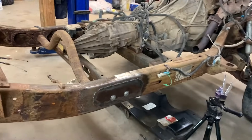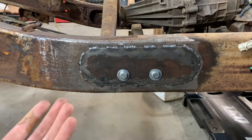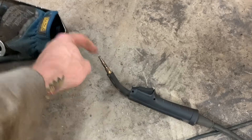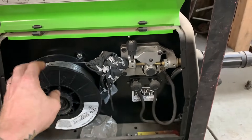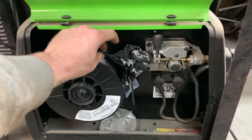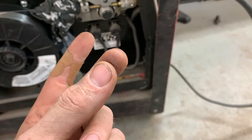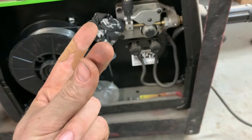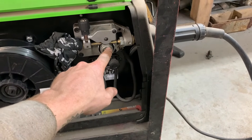Well, it looks pretty good — not bad at all, I'm happy with that. I'm going to put some paint on it. The welds don't look pretty — I'm using flux core and the welder is really giving me issues. I can unscrew the tip, put a blow gun on the end, and out comes this big plume of black sooty stuff. It's like soot coming off the wire, plugging up the whole whip, and it actually spins the wheel trying to push the wire through. Quite annoying, but power through, suffer through.